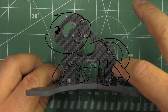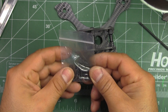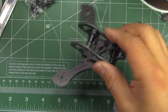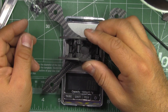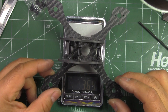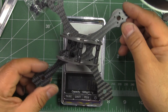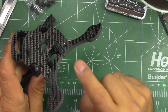You can see the 'monkey' silhouette right here — that's why they call it that. There it is after getting assembled. You end up with a lot of spare screws, nuts, and even an extra spare standoff, which is pretty good. The frame by itself is supposed to weigh 45 grams, but the scale reads 48.4 grams — slightly higher than advertised, probably due to differences in plate thickness.